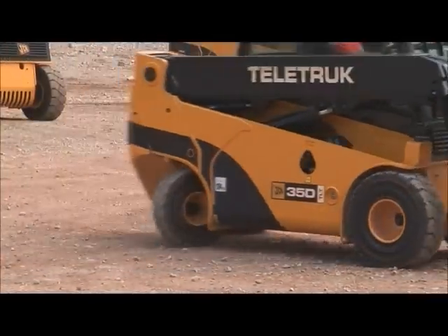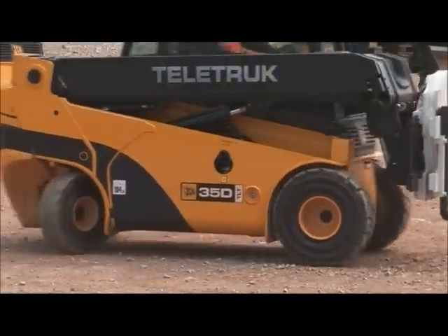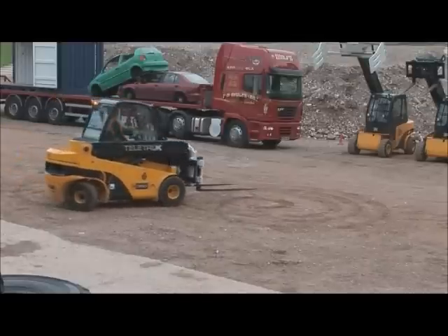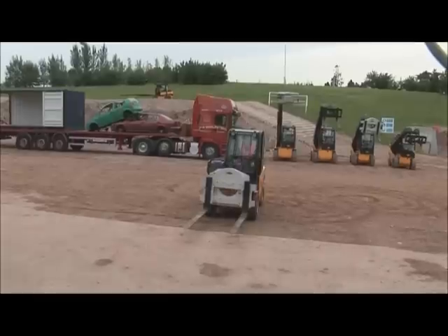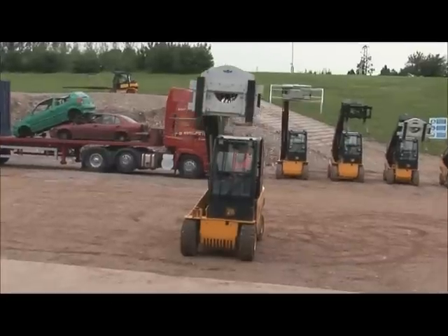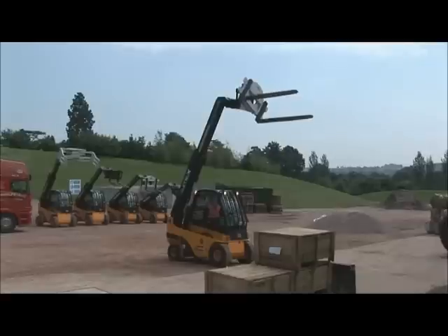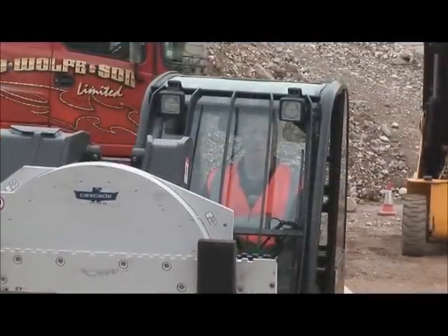With Darren safely at the wheel, enter the world's most versatile counterbalance forklift truck, the JCB Teletruck. The 3.5 tonne two-wheel drive machine is the largest of our two-wheel drive units, with a turning radius of 2.8 metres. It's 1,280mm wide — only 100 millimetres wider than the 2.5 tonne, the smallest machine. This 3.5 tonne machine will lift the full 3.5 tonnes to its maximum lift height of 4.4 metres, and for single-side wagon loading still gives you 2.1 tonnes at 2 metres forward reach.